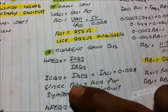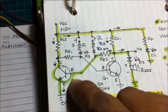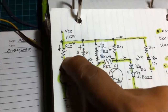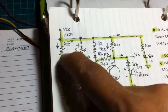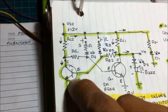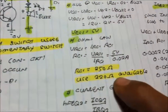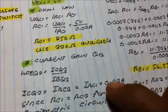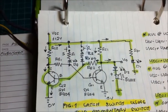Collector current, base current. Since this type of transistor configuration depends on the current gain, IC here. Since we are operating this transistor in saturation, IC is equal to the current at RC2, also equal to the current of the collector to emitter at saturation, also equal to 0.02 ampere